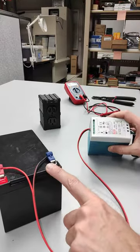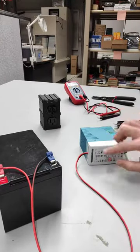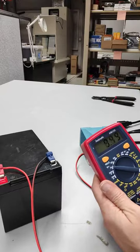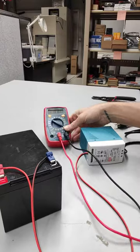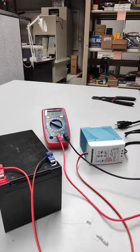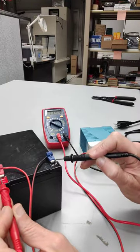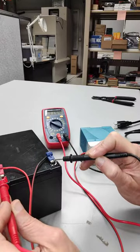At this point the battery does have a connection, so we should be pulling back from the battery to the UPS — the positive and the negative lines. Let's go ahead and test that. I'm going to take my multimeter and put it on 20. I am going to test the battery connection. Applying the positive here and the negative here, you can see I'm just under 12 volts — 11.93.